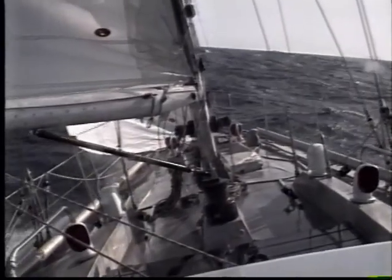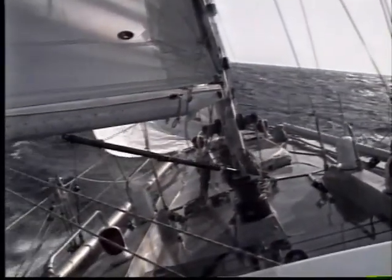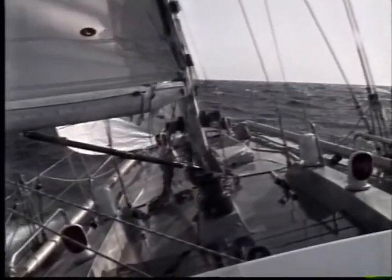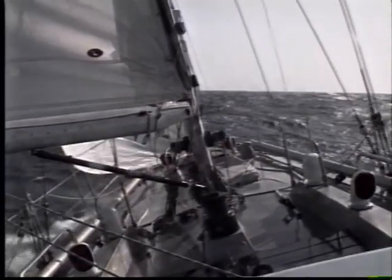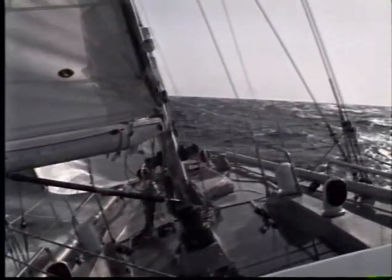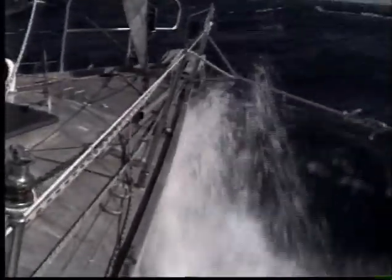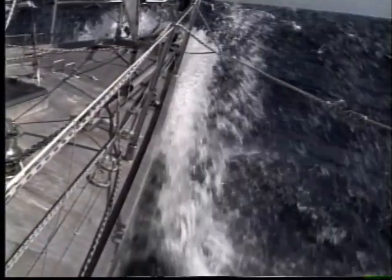And if we slowed down, instead of being rock steady as you've seen, in these seas we'd be bouncing all over the place. When you're driving hard downwind, you don't want to stuff the bow. That can lead to all sorts of unpleasant complications. We solve this problem by eliminating bow overhang and pulling the cutwater forward. Instead of using reserve buoyancy to hold the bow up, we do it with inherent waterline stability. That's what you've been seeing in the shots of Sundeer's bow going through the water. Watch how it's held high as Sundeer drives off these waves.